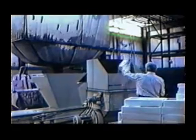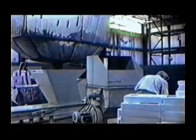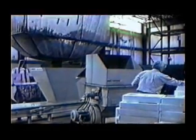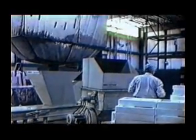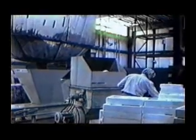In this application, large pieces of scrap EPS are being fed into the pre-breaker. They are broken into pieces about the size of golf balls and then blown into the mesh material holding bag hanging over the hopper. They then fall into the machine hopper where they are pushed forward by the densification ram.